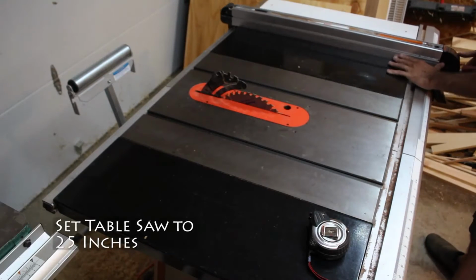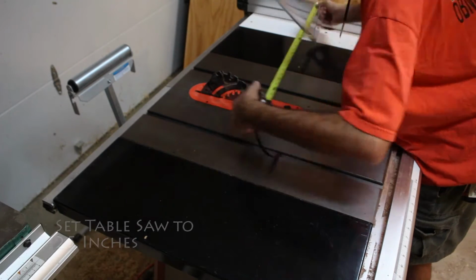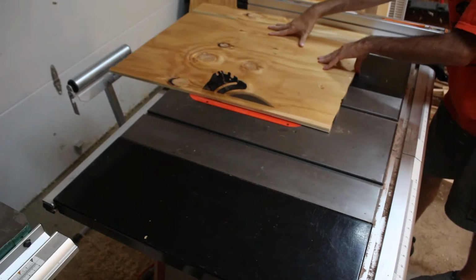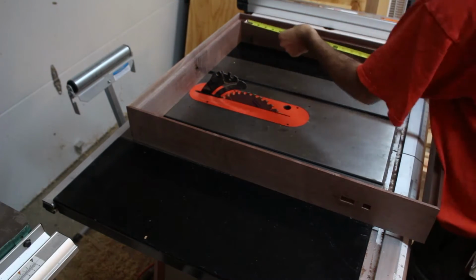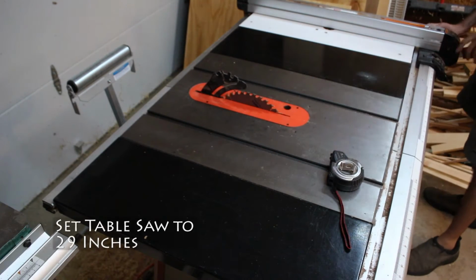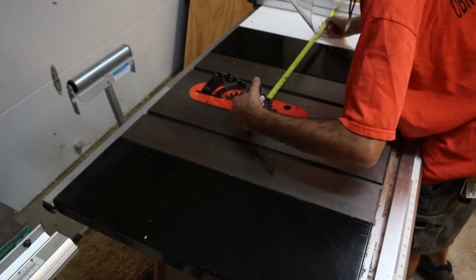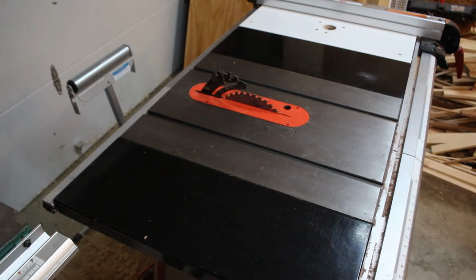Take a 1/2 inch thick sheet of plywood and we're going to cut it to 25 inches wide by 29 inches tall. While I typically use the table saw's scale to measure out distances, on long cuts I like to double check it against a tape measure. This ensures that at long distances I have the proper cut the first time.